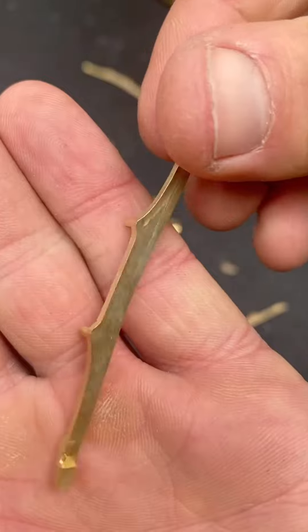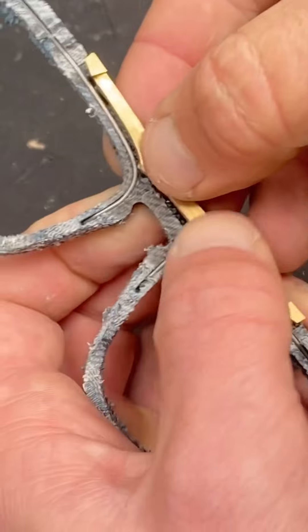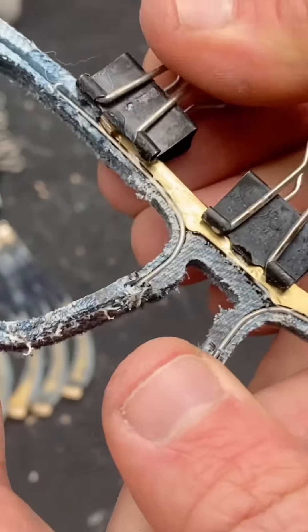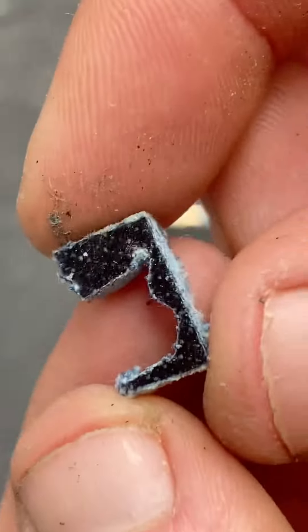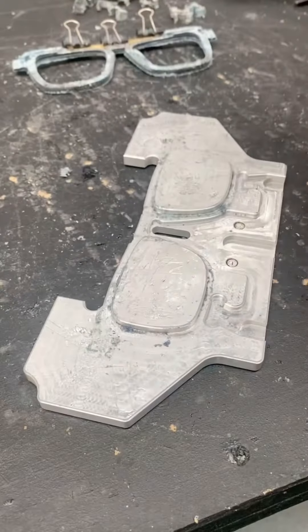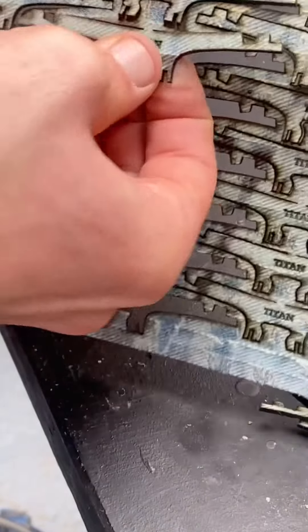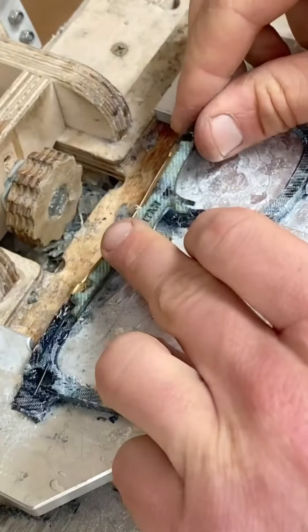The frame fronts are first prepared by inserting pieces of brass and steel wires that'll provide reinforcement in important areas. This is the stage where the frames and the temple arms get aligned. A small piece of that denim material gets glued to the temple arm — this will eventually be the closing surface of the hinge. The frame is positioned in the assembly jig, and another laser cut piece is glued into place.